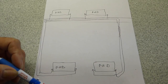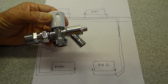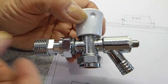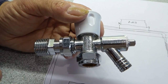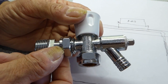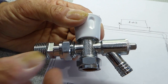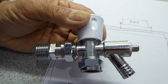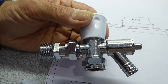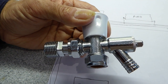So we've got to get a drain valve on there. One of the answers I'm going to show you today is by changing the radiator valve to one of these — a drain-off type radiator valve. I'll put a link to buy these from my Amazon shop. One version has a small nut, so check your radiator valve — it may be a Pegler-type valve with a small nut — but if you've got the large nut version I'll put a link for that too. I'm going to show you how to fit one of these without having to drain the whole system, just the rad. You've got to be a bit quick with the changeover, that's all.